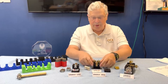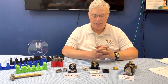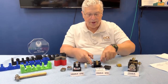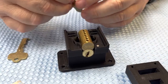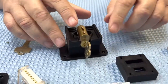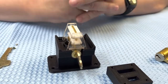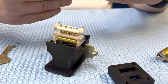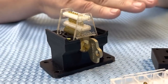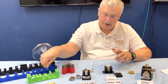What we want to talk about right now is what we're calling the Cradle SFIC — Small Format Interchangeable Core — which we all know is the best type of core. On the SFIC Cradle version, we hold the core. We can now try the individual key inside of the core itself, and you can also try our Go/No-Go tool and you will know exactly which key is cut correctly or not, or which chamber is not pinned correctly. That is a feature we could not get within these three because you physically couldn't stick a key into the cylinder.